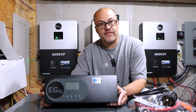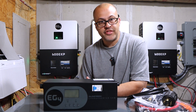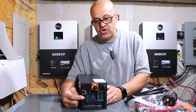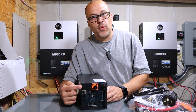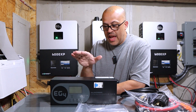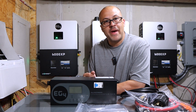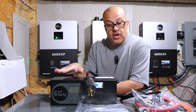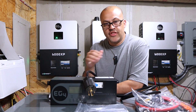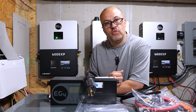The operating temperature for this unit is 14°F to 131°F, and it's IP21 rated — probably just dust protection is my guess. Over on the battery side you've got a few communication ports. On the bottom is your dry contact for generator start/stop, and then your RS-485 for battery communication. The difference between this unit and the other one is the communication — being able to set this thing to start at a certain state of charge and automatically charge your batteries without you having to do anything. You can use state of charge or voltage as the start and stop trigger.